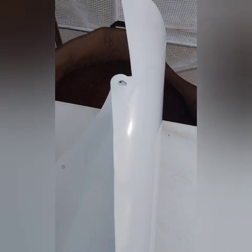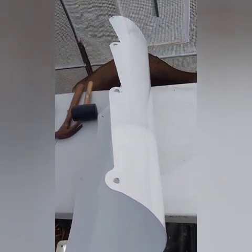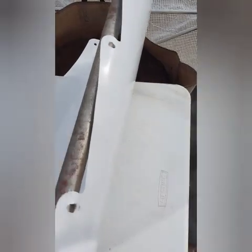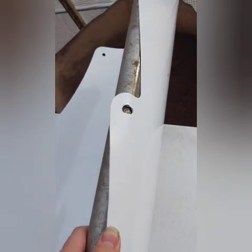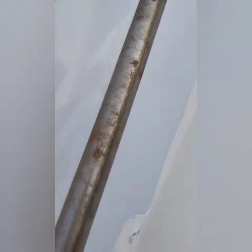The sawtooth side goes to the rod — that goes in there just like that. That's what this metal rod is for, and you can see there are curves on the inside. You can take a metal rod like that and do a little bit of hammering and curl that in there, because those slots — you see how I've torn those slots up getting that thing in there — I actually fought it pretty hard. I realized why: these tab ears actually need to be rounded over.